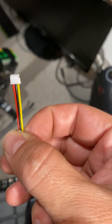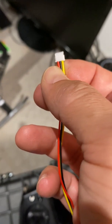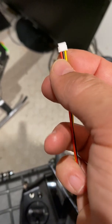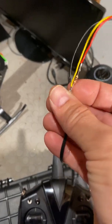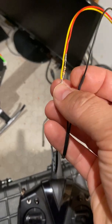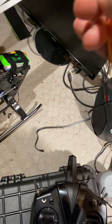What you have here is exactly the pin order that is going to be on your V-Control: the high voltage line is the red one, then the ground is the black one, and yellow is the signal. What you need to do is pick one leg of your thermistor and connect it to ground. Then connect the signal wire to the other leg of the thermistor, and put the 1 kilo-ohm resistor between the signal and the voltage line as a pull-up resistor.